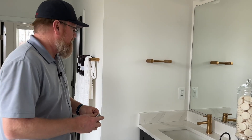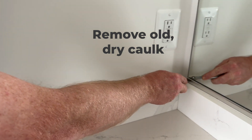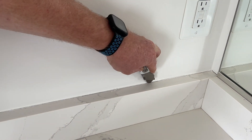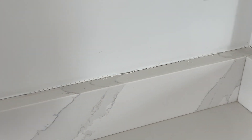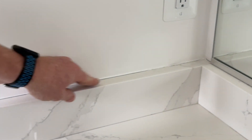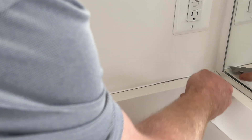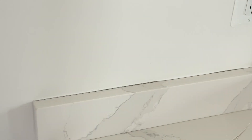Next thing is to make sure you prep the area. Anything in this area that's kind of bumpy and left over, you want to take your razor knife and run it down through here to get any of that old caulking out of there, so it doesn't give you bumps on the new caulk. Get all that out of there, clean up the area, and we are ready.